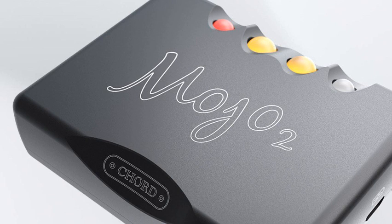High-end headphones are pretty much flat, and the Japanese high-end headphones are pretty much flat as well. It's just the mass market mainstream products that are pretty awful. And then, of course, on the treble side, that's really there to make it sound warmer or to get rid of sibilance problems. If you've got a sibilance problem, you can just drop the shelf down by 2 or 3 dB. And if you want to restore the 20 kilohertz, you could just boost that up again by, say, plus 3 dB, and that will give you a nice suck out between 3 kilohertz and 10 kilohertz.